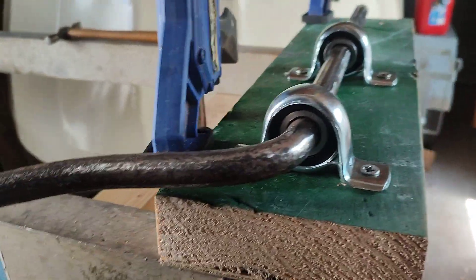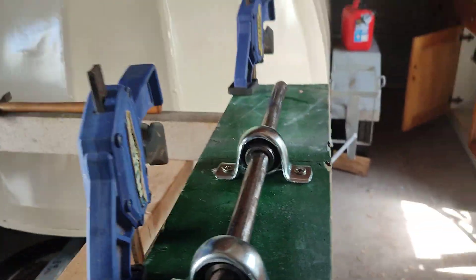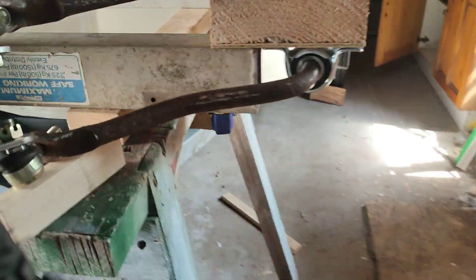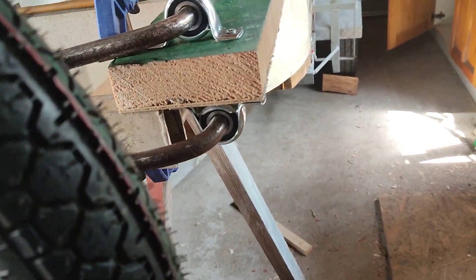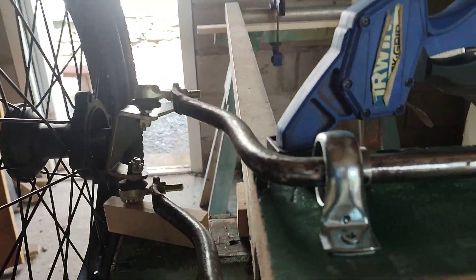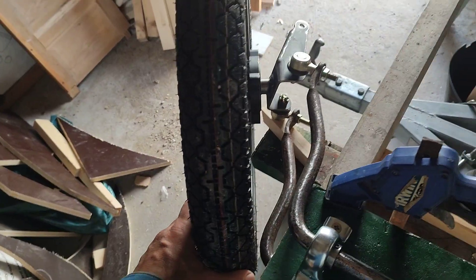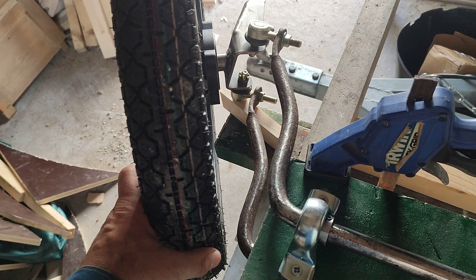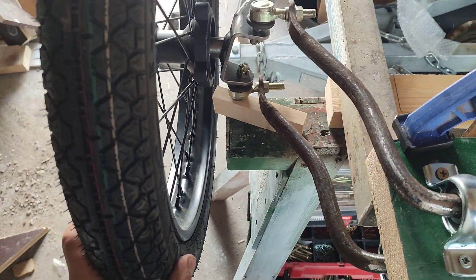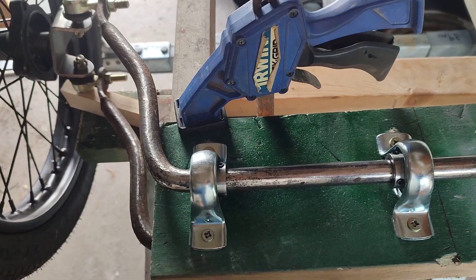With those particular ball joints, the length of them meant I needed a 50mm packer between the two sets of pillow blocks. So we've got the ability to move up and down parallel — hard to see from this side, but there's about four inches of travel. I won't be able to use all that on a cycle cart. The lock on the wheels is better than my other cycle cart, which is already pretty good — in fact probably too much lock. It's come out at over the tires with about a 500mm wide chassis, just under a meter.